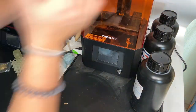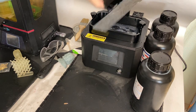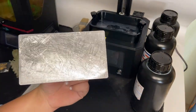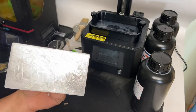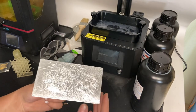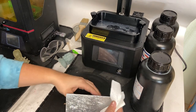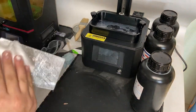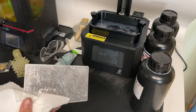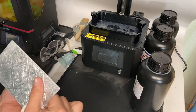I'm going to start by taking the lid off and unscrewing the build plate. As you can see, I've scraped it up a bunch, which is why it's going to be great to have this flexible build plate — so I won't have to do this and ruin the build surface. Let's clean it off with some rubbing alcohol or IPA. Denatured alcohol works also. Just make sure everything is clean so that we have a clean surface to stick our magnet to so that it lasts long and doesn't peel up.